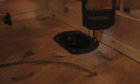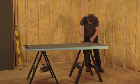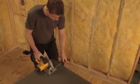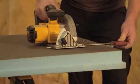In this project, we will cut the Rialito base to length and make it fit in our planned custom shower size. A circular saw with a diamond or carbide blade is used to cut the base cleanly. A handsaw can be used alternatively or, as you can see here, to cut through the rest of the base if the circular saw blade is too short.